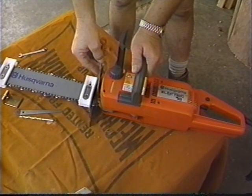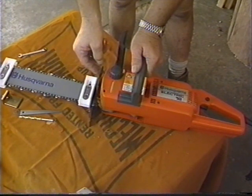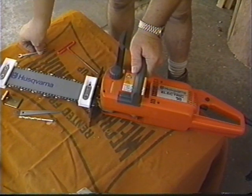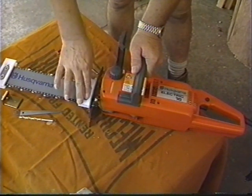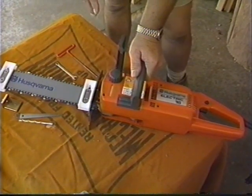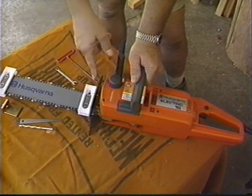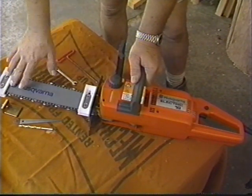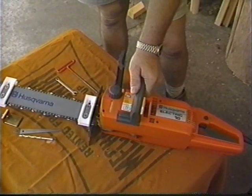First of all, you'll recall I'd mentioned earlier that I had taken these teeth off of this particular saw, but also at the same time, before I reassembled, I put a square 1/4 inch machine surface on that screw, so now I can use an open-end wrench on here. I don't have to take my guide assemblies off. There are other saws on the market that have external chain tensioning screws, but this particular saw, I'm so pleased with the way the saw operates. Just simply machining a square head on that screw eliminated a lot of problems as far as taking these off and on. Now I can take the chain off and leave the guides completely attached to the chainsaw bar.